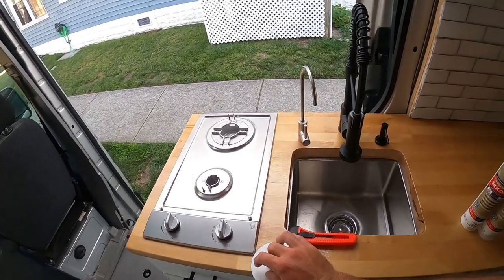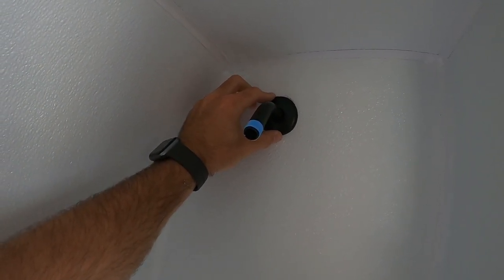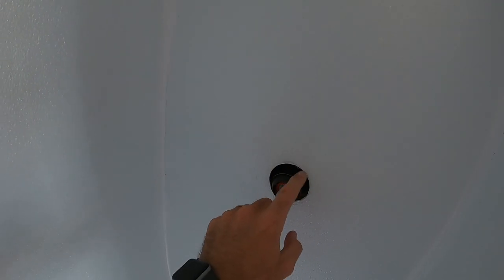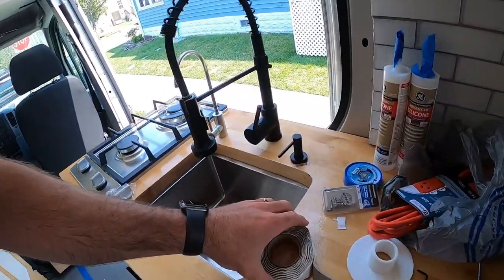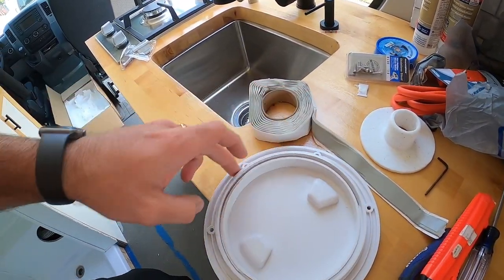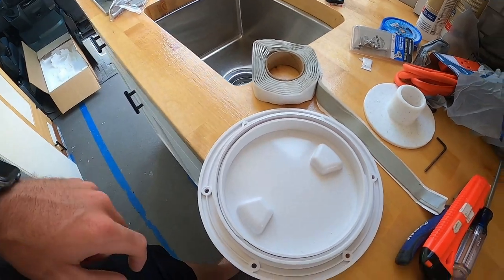Now I'm just going to take the white silicone and seam up all the holes. We got the silicone done on all the high-end water points. Now I'm going to put the pipe thread tape over the shower head and silicone this on as well. I just bought stainless steel inch screws so they won't rust out when they get wet, and now I'm applying Butyl tape to the back of this. I'll screw this in and have Butyl tape covering each hole so no water will get through, then silicone around it.